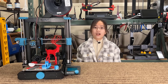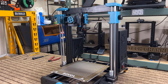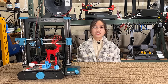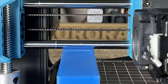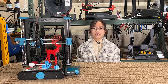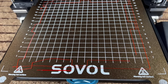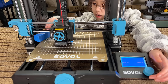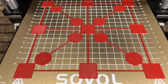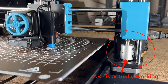Three: the auto bed leveling and auto Z-align are not as good as I expected. After I used the feature to let both Z-axes move to the top and crash, sensorless homing is supposed to align them. However, I used a 25mm tall 3D printed block to check both sides, and the right side is obviously taller than the left — possibly more than what the bed leveling sensor can compensate for. Even after doing another round of auto bed leveling after Z-align, it still results in an inconsistent first layer. The only fix is to manually turn the lead screw to level them and then redo auto bed leveling. Sovol should investigate why the auto bed leveling sensor can't compensate for the difference between the two sides after Z-align.